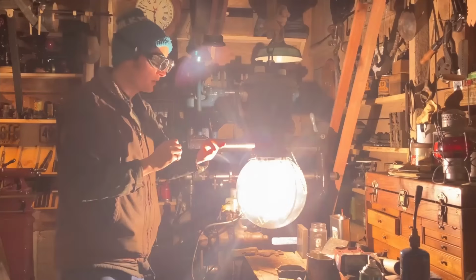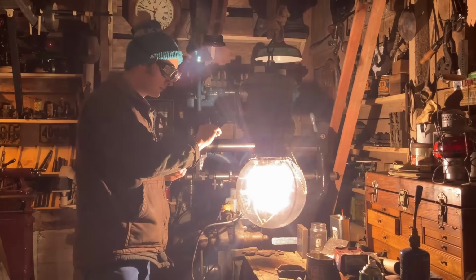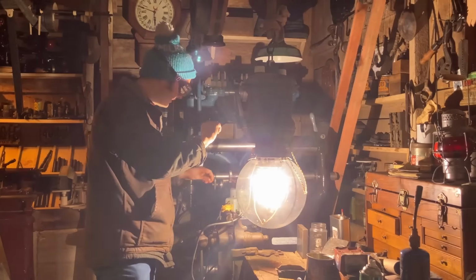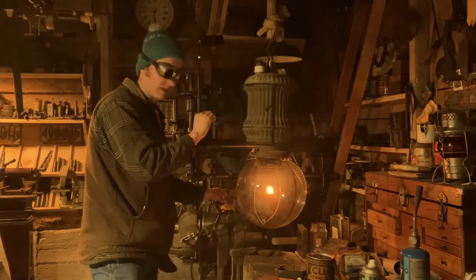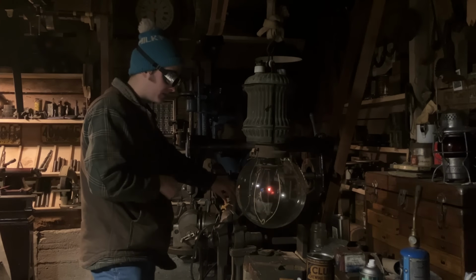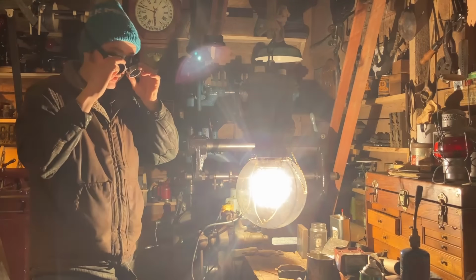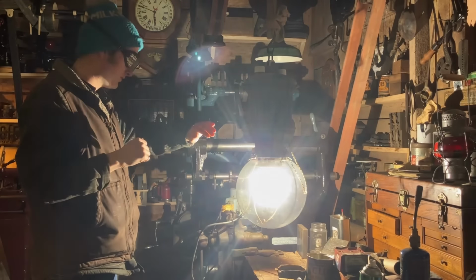Major improvement though, the ever so slight of a hum coming off the device, and there is a little bit of smoke coming out from those carbons burning up because they should be in an isolated atmosphere of the inner globe. Now I'll hit the shut off and you'll hear the rod drop with the solenoid, and it's glowing orange a little bit, and then we can fire it up right away. Comes back on. Very nice glow in here. I'm extremely happy with that.